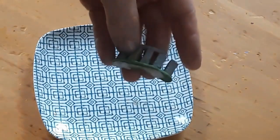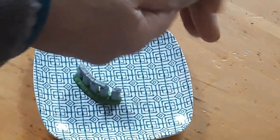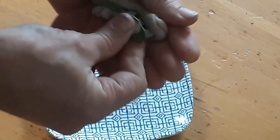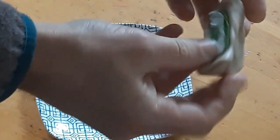To make our mold, we are going to press the object into the Impressive Putty, or press the Impressive Putty over and around the object that we are casting — in this case, a small little Stonehenge sculpture. Smooth out one section of the Impressive Putty so you don't have any creases in it, and press it over your object.